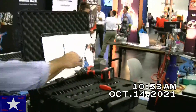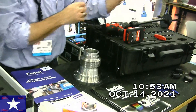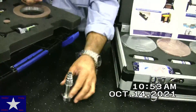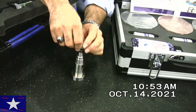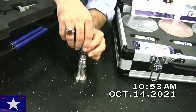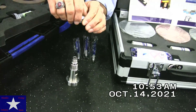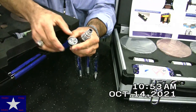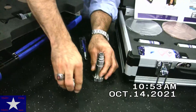What this does is you can come in from the top and it's automated. So instead of doing it by hand, you have a cordless drill to do the work for you. This is your nozzle — this is inside of your safety relief valve. The disc is pushed on top, and the spring is pushing down on the disc. When the safety valve is over-pressurized, this will open if the valve is set properly and it will release. What we do is have the equipment to make sure the disc is perfectly flat along with the nozzle, so you get a perfectly sealable product.